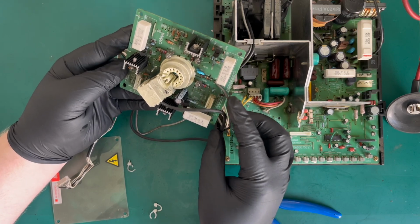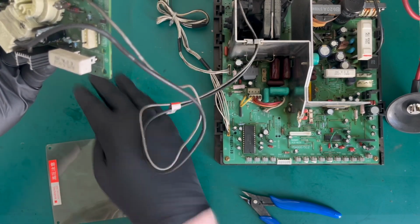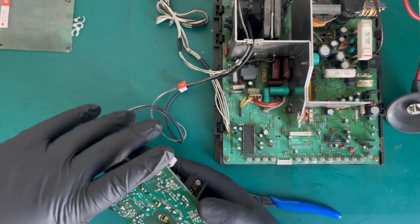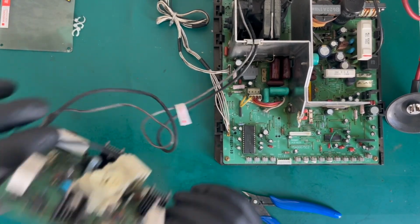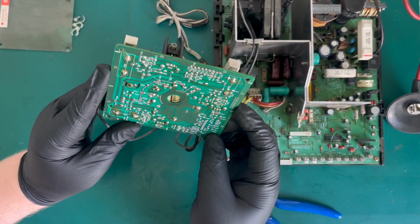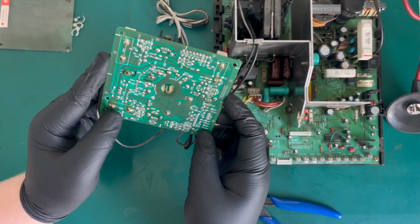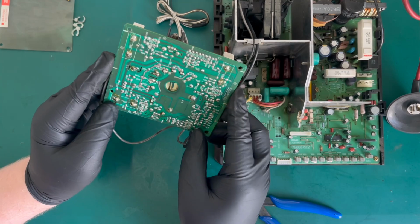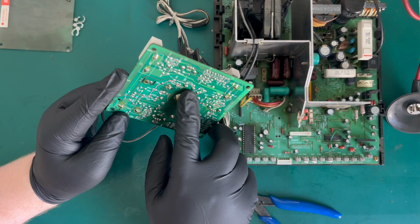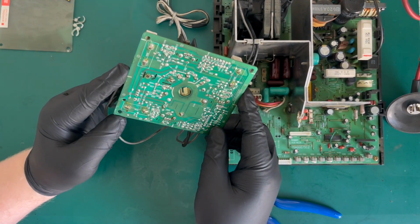Okay, so that's the cable tie snipped, the wires removed, that could be removed. And obviously we've got to desolder these two wires here, but we'll just have a quick look at the back, see what we think. Where's that capacitor? There it is at the bottom there. Yeah, a bit of flux residue, but doesn't look the worst I've seen. Obviously flux on the resistor points there. So we'll, again, give it a bit of a cleaning, a bit of a reflow. Possibly reflow these pins, but to eye it doesn't look hugely bad. We'll get it under the scope a little bit later on.